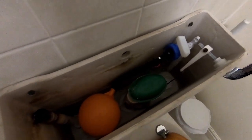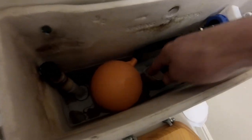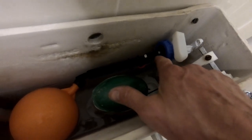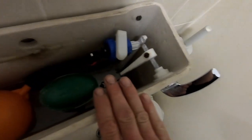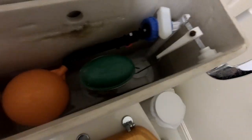I've let that fill back up. Two things I've noticed: the water level isn't particularly high — that should be set higher. Somebody's put a new fill valve in there and you can see they've left it at its maximum adjustment, or minimum adjustment, whichever way you'd like to see it, so that it's shutting the water off early.